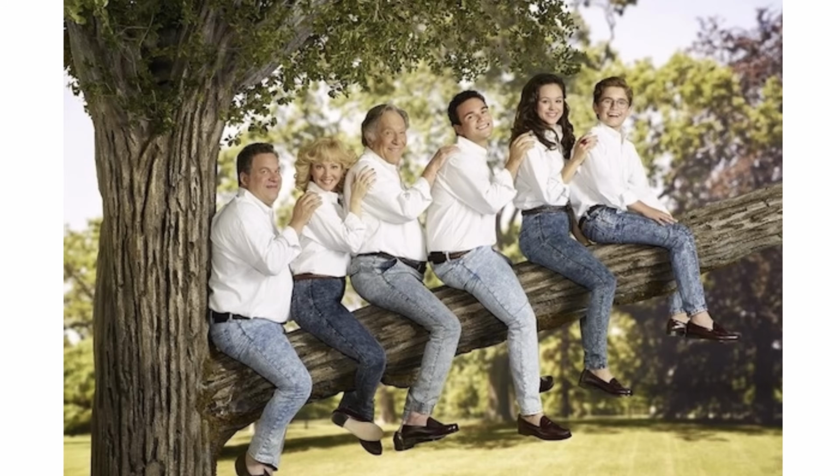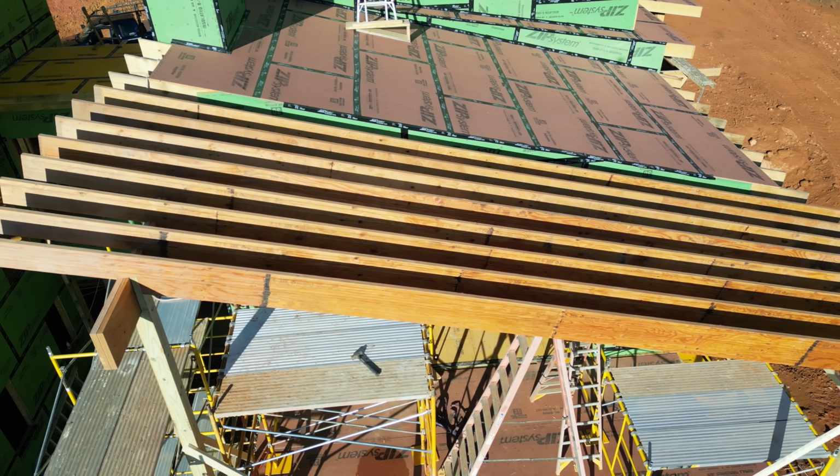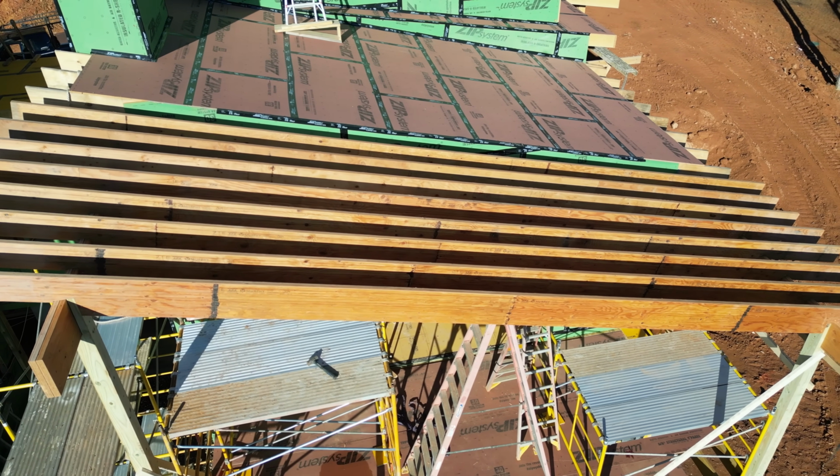Now you mentioned that all the sawhorses should match. Is that so they look pretty? Yeah. No, not really. All right, let me tell you why. They need to match so that at least they're the same height, because we don't just use sawhorses in pairs of 2. A lot of times we'll use 3, 4, 5, even up to 6 when we're supporting super long material like these 28 or 32 foot long LVLs that we've been using recently.